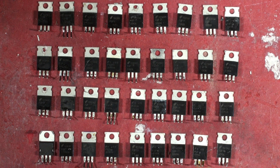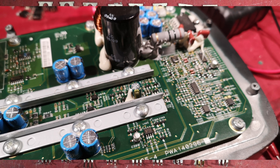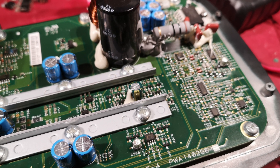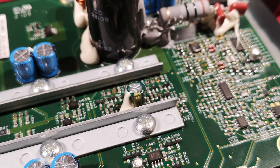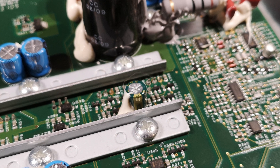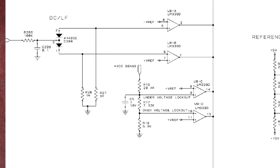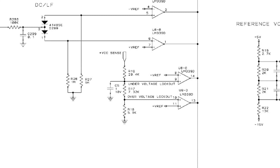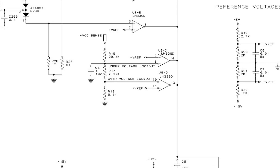This week's toll is from a JBL 515 — 500 series 510/515 XT — specifically the LF output transistors, the ones that drive the big 15-inch bass driver. About halfway through the week I'd repaired one and it was testing, and about two hours into the test at 100 watts the light went off and it had failed.